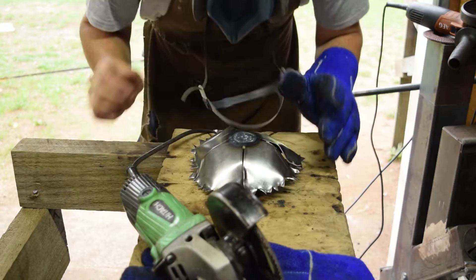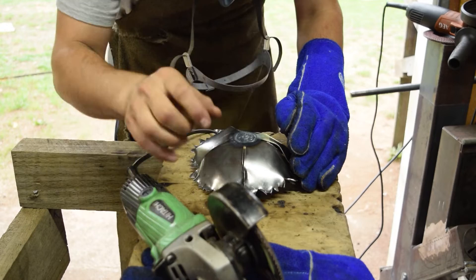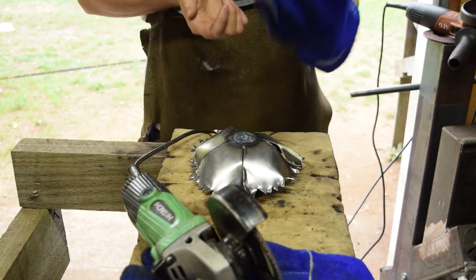We've got the poppies all looking good. We now need to clean the back up, so we're going to smack that down with the flap disc and then a wire wheel just to blend it out before we weld the rod on. Obviously if we've got the rod on we won't be able to do this, so something to do now.